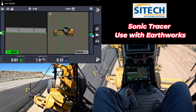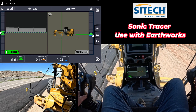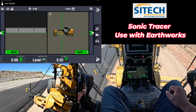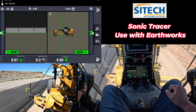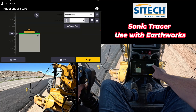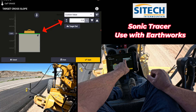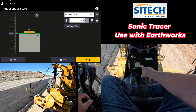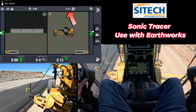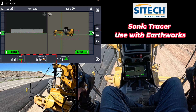You can imagine if I lift it up it's going to be pointing down, and if I'm too far down it's going to be pointing up. I still have my cut fill right here. I can go ahead and turn on my autos on the left side. Now as soon as I start moving it'll follow with my auto on the right side or left side. I can also turn on my right auto which is going to hold a flat grade. You'll notice at the top of the screen it's just in level — on the left side I'm matching the existing asphalt and on the right side the blade is level. You can touch on your level at the top and put in a percentage. If we wanted one percent, keep an eye on which way it goes — the plus or minus is going to go up or down one on the right. Right now I'm down one percent on the right, I hit apply and you can see it at the top. Hitting auto on both sides again — matching left and holding a percentage on the right — you can see the blade went down just a little bit on the right side.